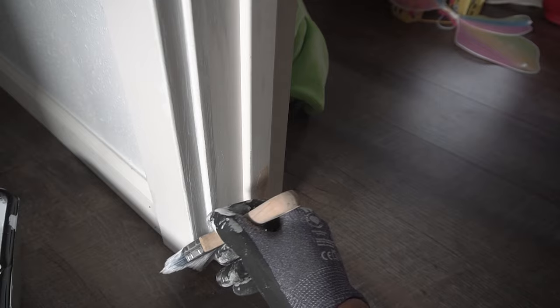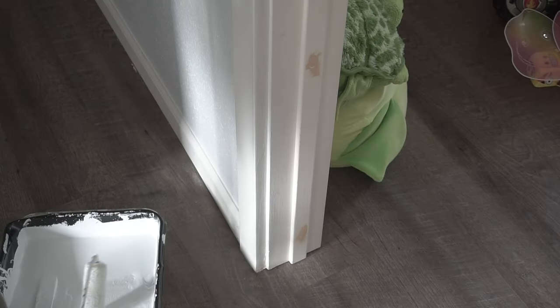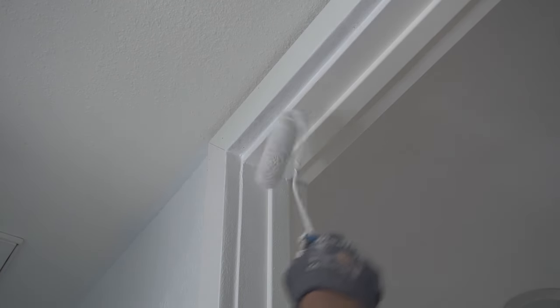Make sure you focus on the edges and those inside corners. The first coat is going to soak up a lot of paint — the wood filler is very thirsty on that first layer and will absorb all the moisture. If you have primer, that works too, but in this case I'm going to do double coats of paint. Running it through with a roller brush will give it a nice consistent texture — it all depends on the roller you use, but we'll run it throughout for a nice smooth finish.